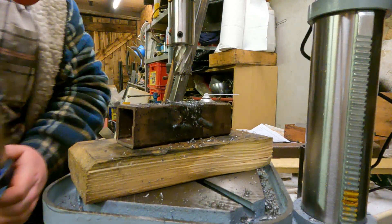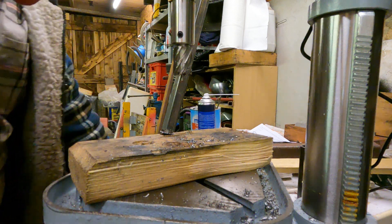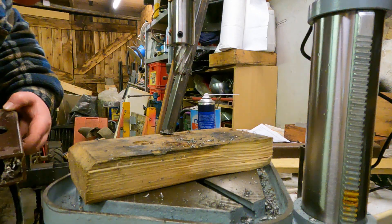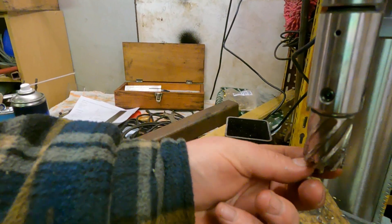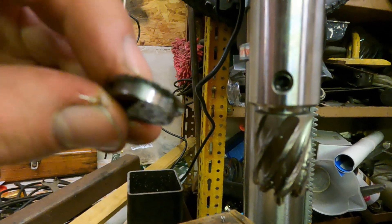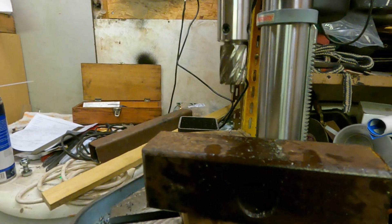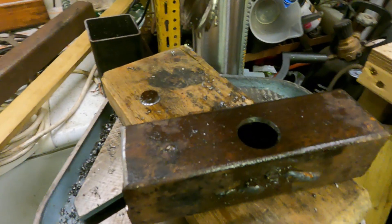Let me just clear this off for you. Well look - there's my slug, and that will always get ejected because of that pin. That pin is on a spring and it will always eject it. I didn't find the other one - I wonder where that one went. Anyway, there's my hole - you can see I've drilled another one there as well - and it's absolutely clean and pretty precise.